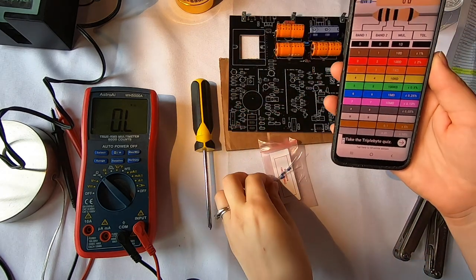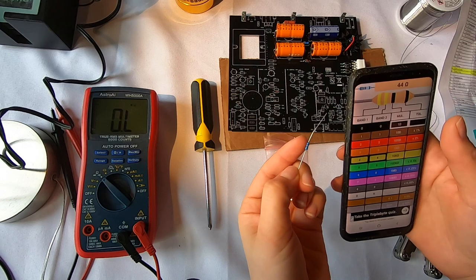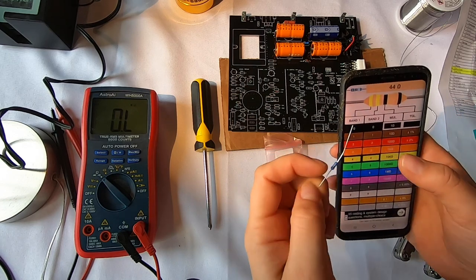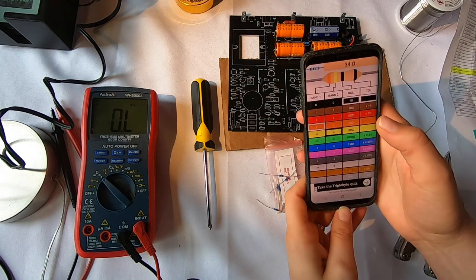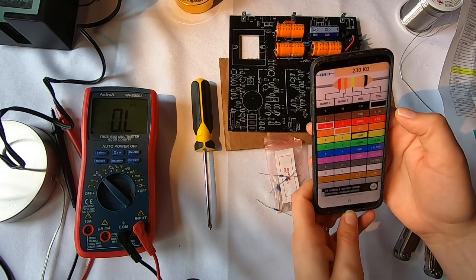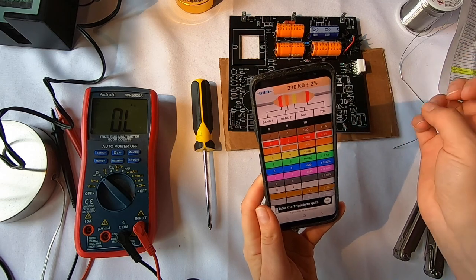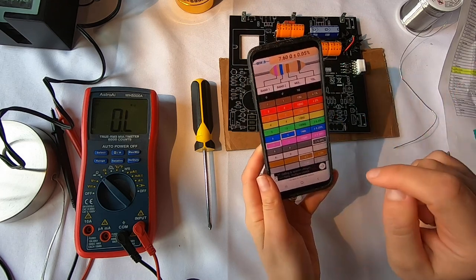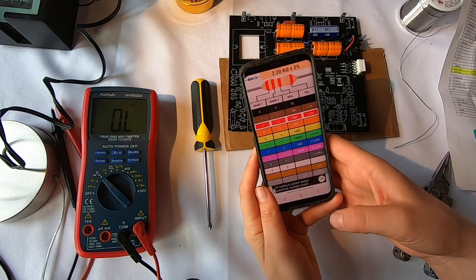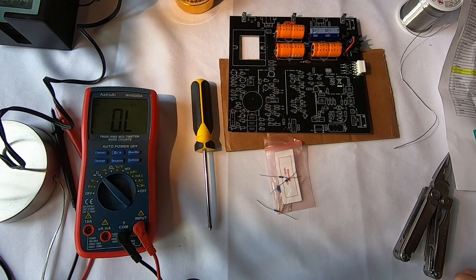And what you do basically is you go, okay, so this one has red, green. And sometimes what you can do is, if it's hard to see the colors, you can take a photo and then zoom in, and that sometimes makes the colors more obvious. But basically what you do is you pick up a resistor and you go, let's say it's red, orange, yellow, and then red. That'll tell you that it's a 230 kiloohms resistor. That's kind of big. But point is, you just tap in the colors on the bands here, and this app will tell you what the value is for that resistor. So this is a pretty handy app if you're working with resistors a lot. You can also just learn how to do the math for it. It's not as fast, obviously. But that's my story. All right, so I'm gonna start building this.